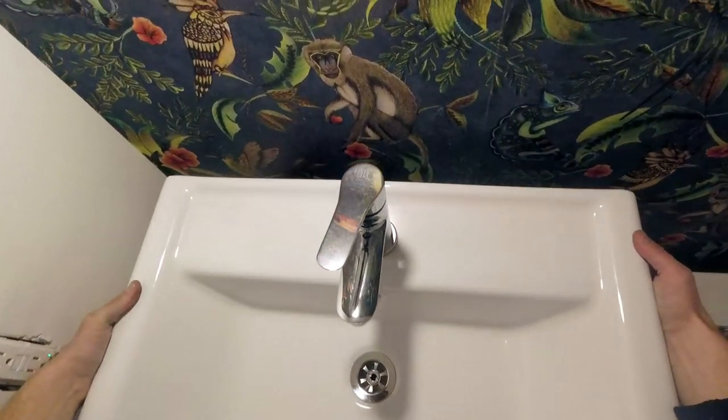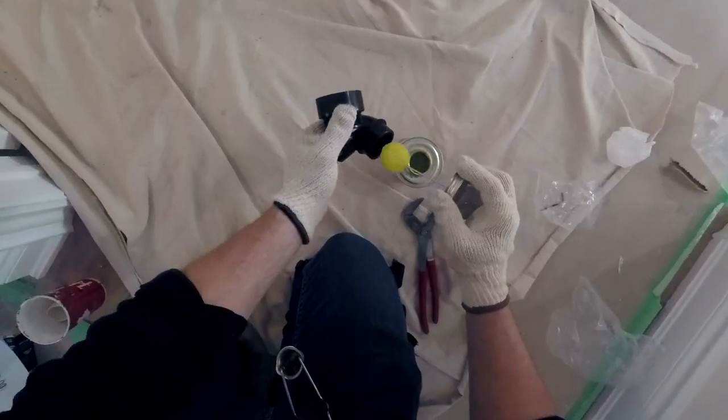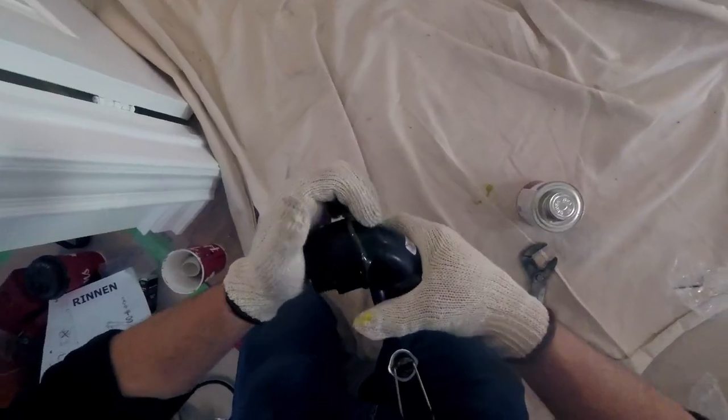I'm allowed to put in the fitting 90 because we're allowed a total of 135 degrees of turn before we get to our protective vent, but it is atypical to use a trap adapter to secure the trap arm of a P-trap, and we only really use this strategy in applications of IKEA drains.